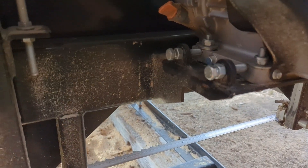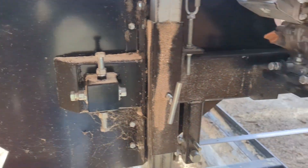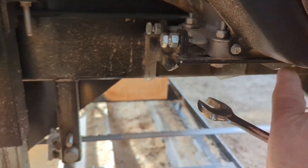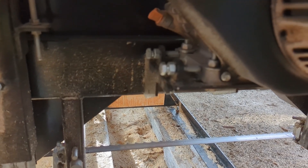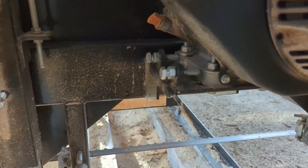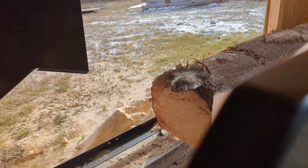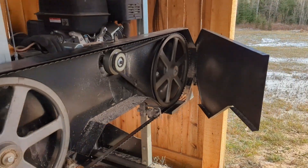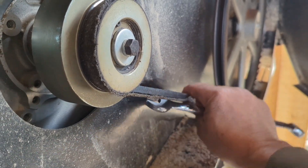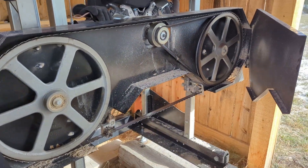I can tell it's a bit crooked — I can see it's twisting the motor because I'm applying pressure, so we've got to bring this back. The belt is pulling on the motor as I'm adjusting it, sending one side that way. So maybe lock down this side and only pivot it with the one adjustment screw. We've got it way tighter now — that's almost like a car fan belt tightness.